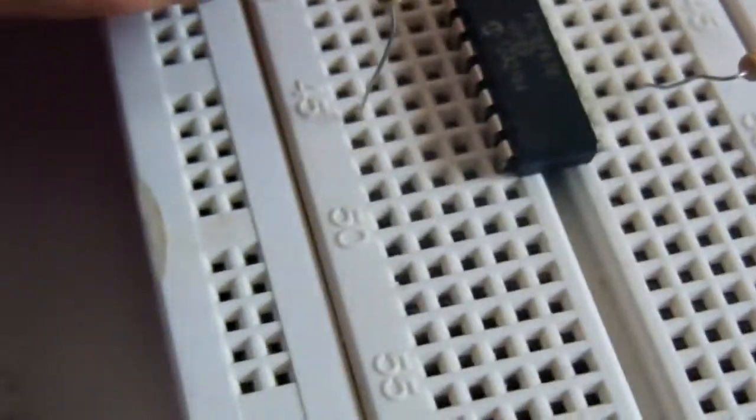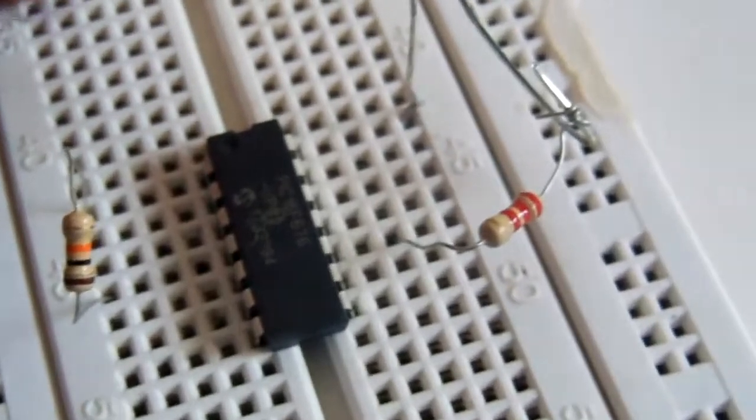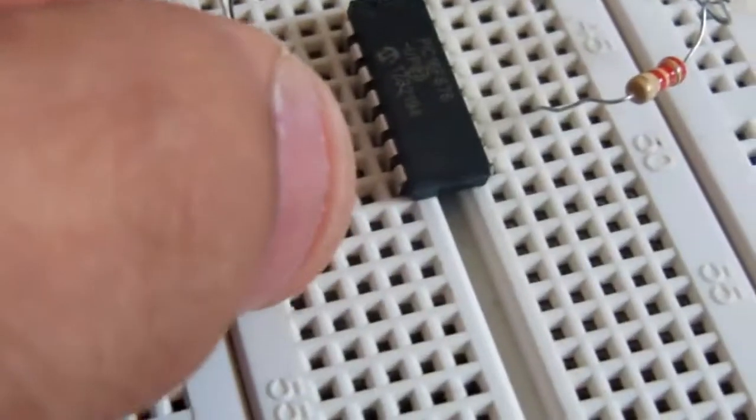And this way, you have to take this one LED. This is the 10 pin. This is the pin number 7, 8, 9, 10. Ground. And then pin 4. 1, 2, 3, 4 pin, with VDD. Pin number 4 is connected by a 10 kilo ohm resistor with VDD.